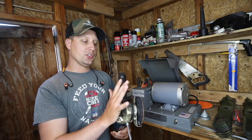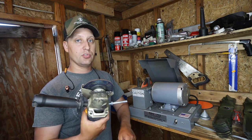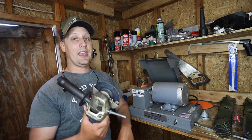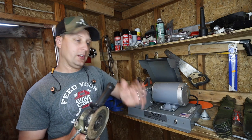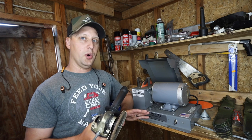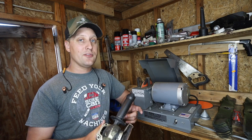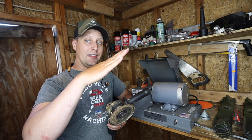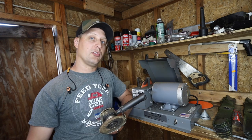Some of the pros: they're cheap, you can get these almost anywhere, they're portable if you've got a battery one, they're inexpensive, and the wheel can last you almost a couple of years if you only have a couple of blades you're doing. But here's the cons: you can't always guarantee that you're going to get that 30-degree angle with an angle grinder. For a lot of people just getting started, mastering that 30-degree angle with an angle grinder is difficult. Eventually the blade angle starts drifting and you just can't get that perfect 30 degrees the whole way through.